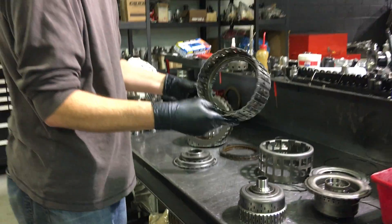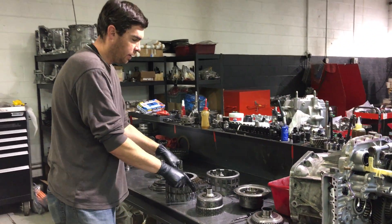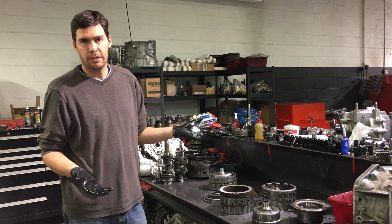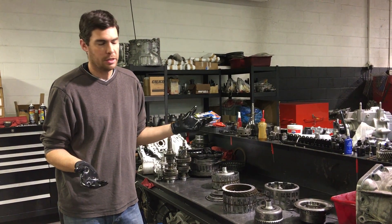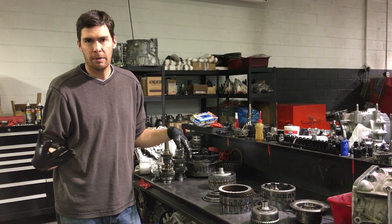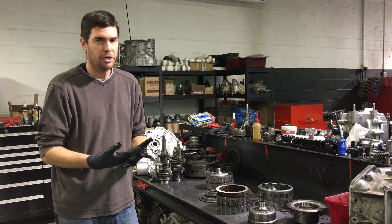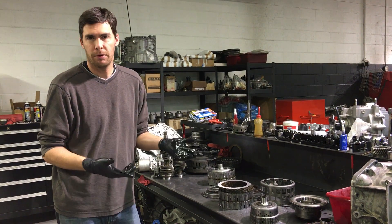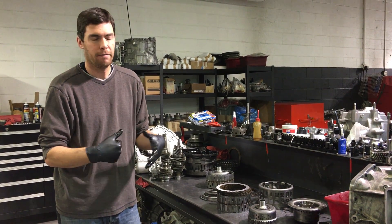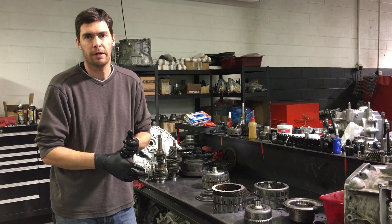So that's about it. There's the carrier — you can see it's divided in the middle. That's a very basic explanation as to how this clutch system works. Basically all the clutch is doing is transferring engine power to the gear set in a smooth manner. The less pressure you have, the more slip it's going to have and the smoother the engagement. The more pressure you have, the more everything is going to generate friction, and the more torque it will transfer to the gear set.